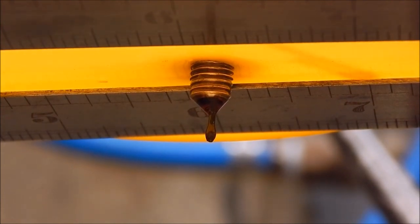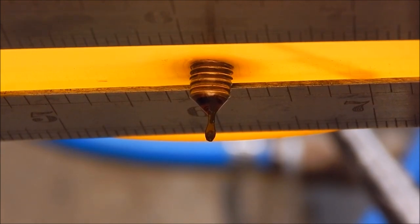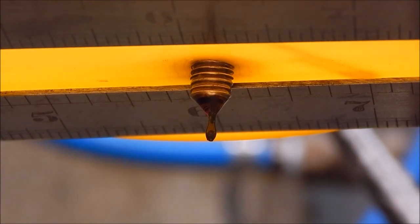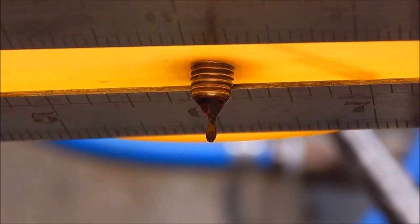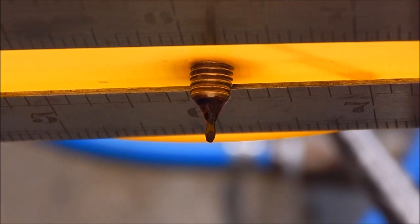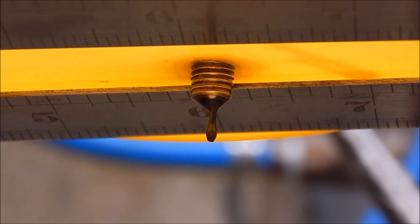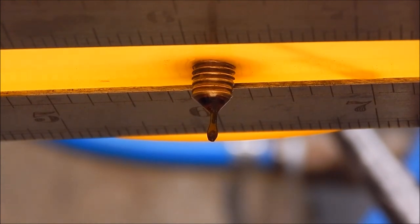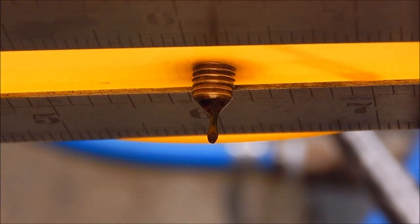It's working quite nicely. I've changed the wire though from what you saw me drop in the cup in the previous video — to non-galvanised — because I wasn't getting a very good result. I've always used non-galvanised wire on the Shoreblend and it worked good. Steel wire or even copper wire would work, but I'm currently using plain black steel wire. For this video I just plonked in a bit of galv wire I had about the right diameter to see, to give you the low down on this. And for some weird reason it just wouldn't work properly. I think the galvanising on the wire — the cadmium plating or whatever it is — was the culprit. The oil just wasn't coming down it like it should. So now I'm using the same sort of black wire as I've used on the Shoreblend and it's working beautifully the way it should.